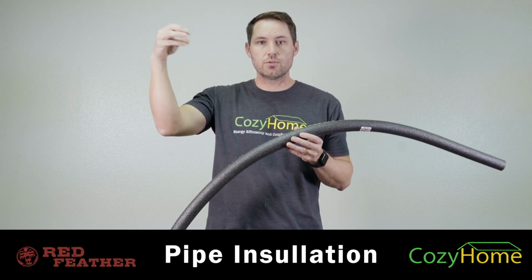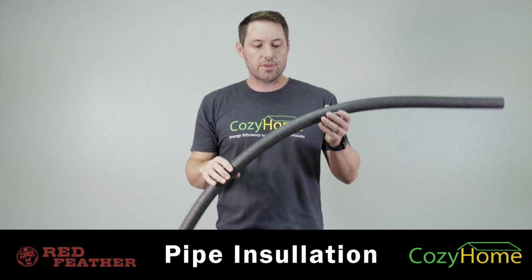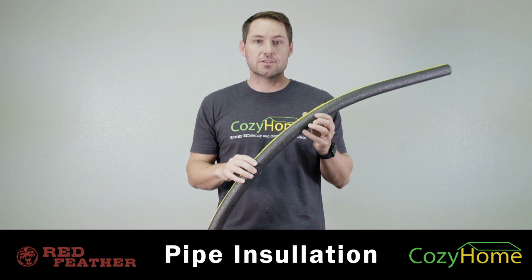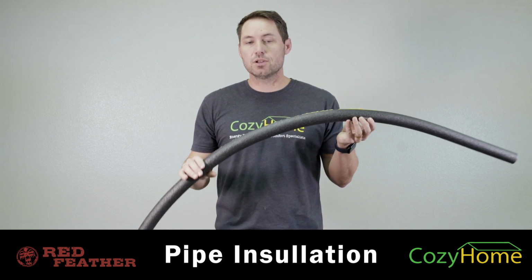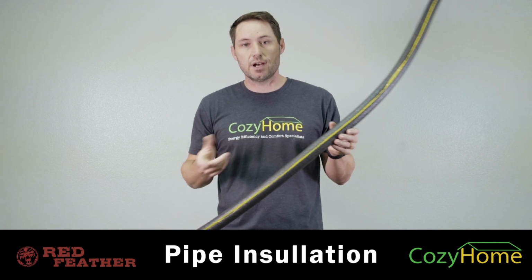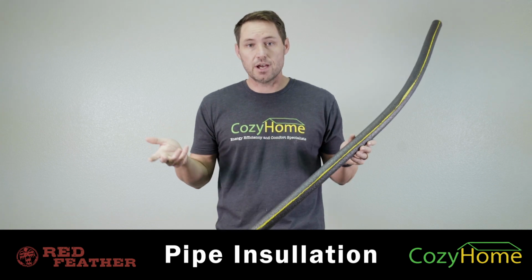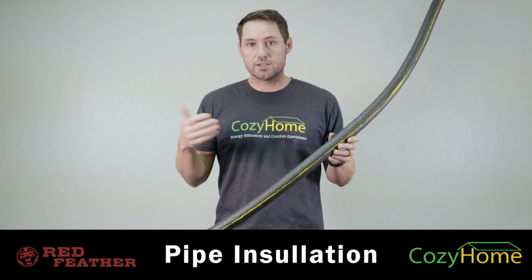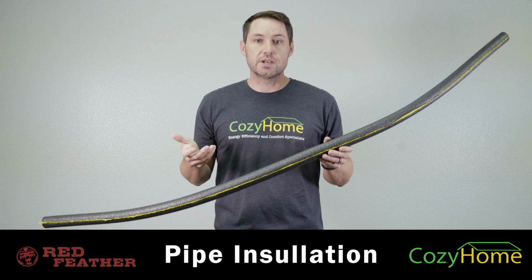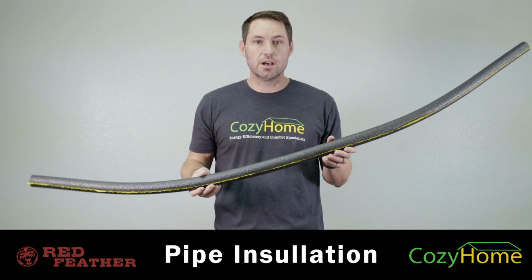A lot of times water heaters transmit heat up through the water heater pipes, and so this will help insulate that to make sure that you're not losing that excess heat. It'll also help get hot water to your faucets faster as well. If you do have pipes that are located maybe underneath your house or in an area that's exposed to the cold, you can put this on any pipes in those unconditioned areas as well, and that'll help prevent them from freezing. If your plumbing runs underneath a slab or maybe inside your house, those ones probably don't need to be insulated, only the ones that are in unconditioned, unheated spaces.